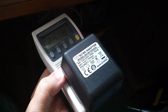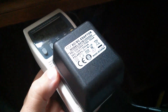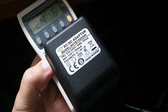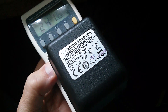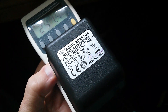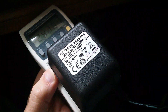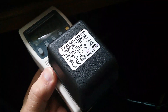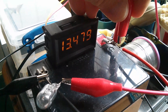I'm not using a solar panel - I'm using an old power supply with a transformer, a rectifier, and a smoothing capacitor. These 12-volt power supplies put out about 18 volts open circuit, and when you load them up that voltage drops - they're unregulated of course. That's what I use to test the PWM-5s: an old-style power brick. So my sunshine level is being faked with my transformer.